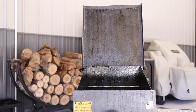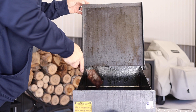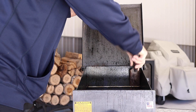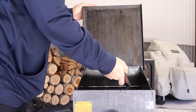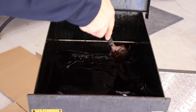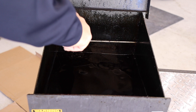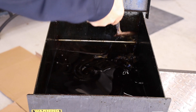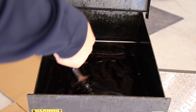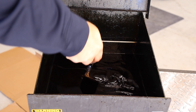While this thing is warming up, we're going to take it and get all the little crusties off that may have dried on, so we can get them into that oil to drain. Any crusties that have dried on the inside, we're going to get those cleaned off — just get a little bit of that warm oil up there and it comes right off. The oil came up to about 150 degrees, so we're going to let it cool down a little. Get all those crusties and old dried oil out of there, and you're also getting oil on the sides to protect it. We'll let it cool to about 125-130 and then start to drain.